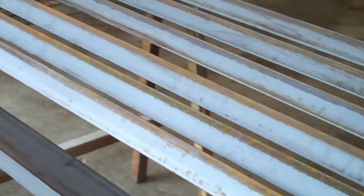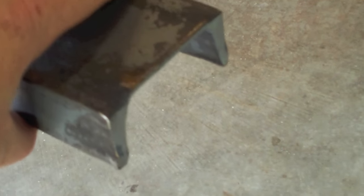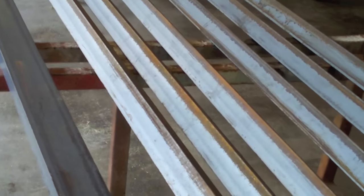We're starting out with raw steel, laid out on sawhorses. We've got our channel iron — this is what we're going to use for our hitch, it's 3 inch, 3.5 pound. I've got some 2x2x1/8 inch angle iron for our top frame rail. The main structure of the trailer is going to be 2x2x3/16ths angle iron. This video is nothing flashy — we're in my garage. I'm going to start cutting framework pieces and show you how to set this up.